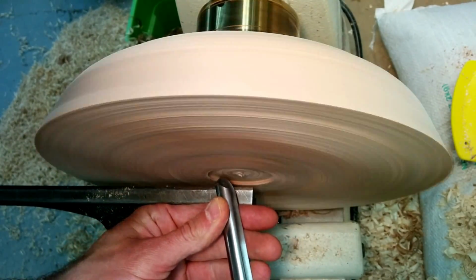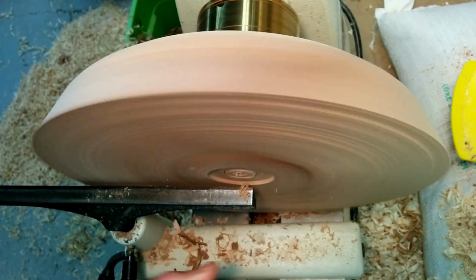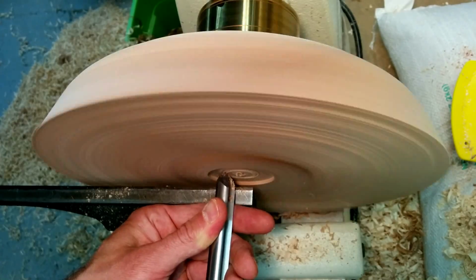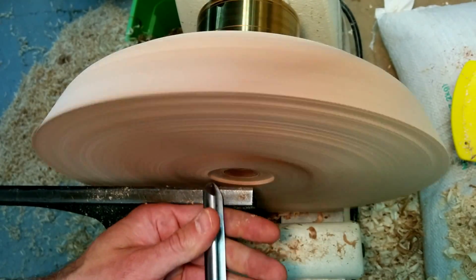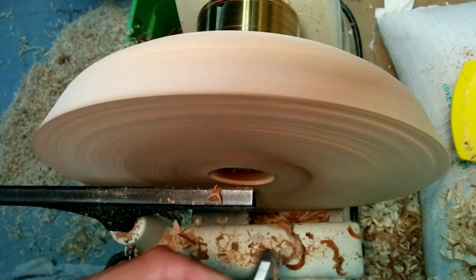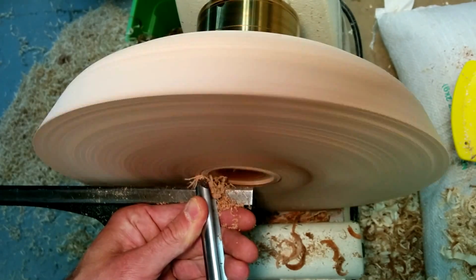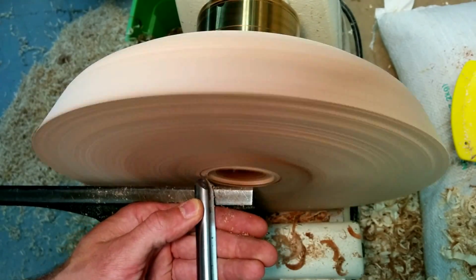So I'm going to make my V cut with just the tip. There we go. So now on the left-hand side, I have a new home, a safe place for my bevel to ride. Turn, very fluid. Now these middle cuts are pretty easy. There's not a lot going on there. So there's my V, and that was again made with the flute facing right.